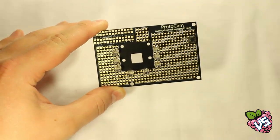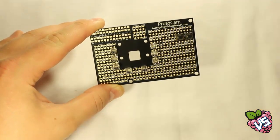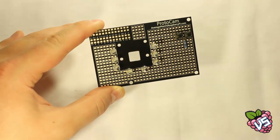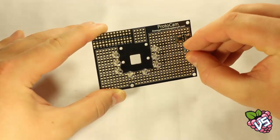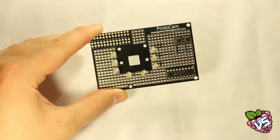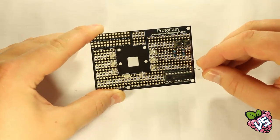Now we're adding some buttons — one to record video, and the other one will take a still image. Setting these up using Python code is really easy. Each will be connected to a separate GPIO pin as an input. We've also added a port expander to save using up GPIO pins, which can be limited.